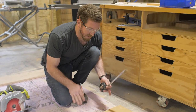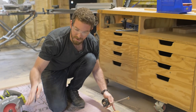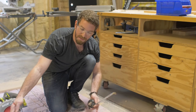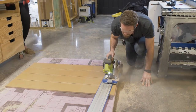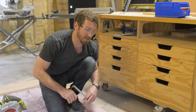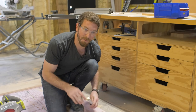The bottom of the planter sides are twelve inches and the top is sixteen inches. When measuring out for the first cut on the side of the board, measure in two inches and then lay out the bottom, which is another twelve inches — mark at two and fourteen, then cut up to the corner and out to sixteen. Again, all of this is in the plans, so if you need a pictorial layout you can get that on my website.